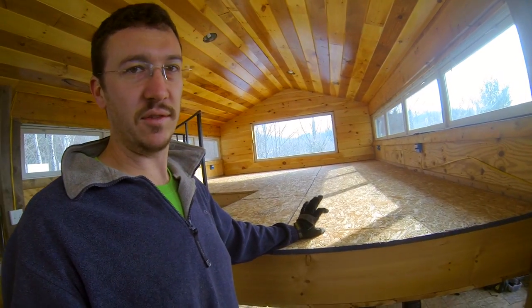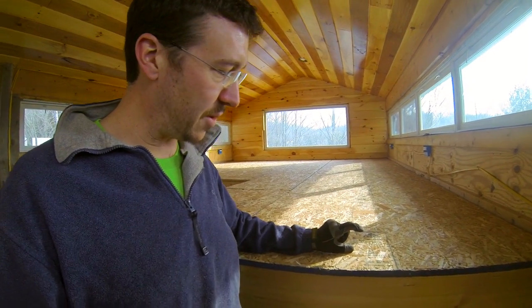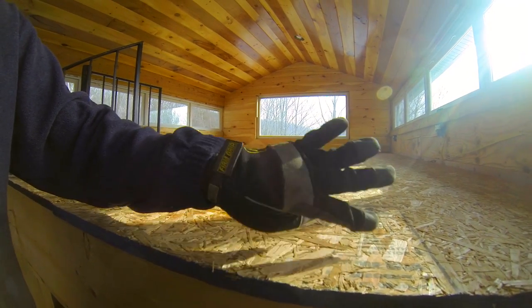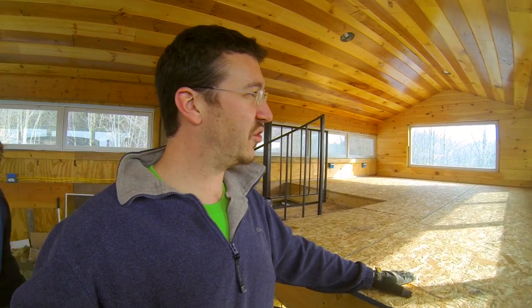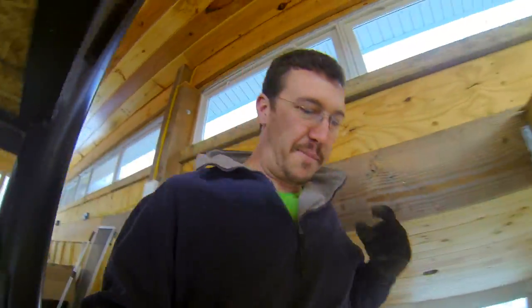So what I'm going to do — because I'm using two layers of pad, since this is somewhat of a crawl space and I want it nice and squishy — the tack strip is going to be somewhat lower than the top pad. So the carpet will dive down to the tack strip and probably won't hold very well. So I'm going to build the tack strip up so that the carpet comes across and hooks onto the tack strip level. We need to find a thickness of material to build up the tack strip so that it equals the thicknesses of the two types of pad we're using.